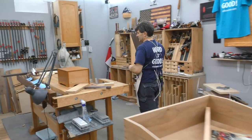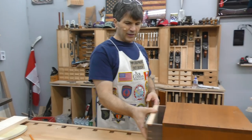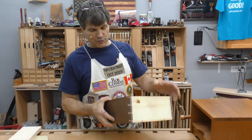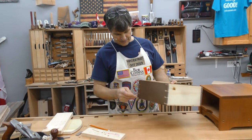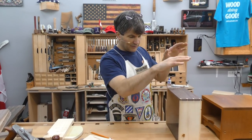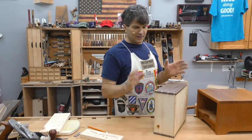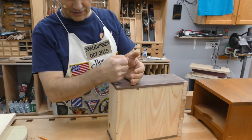In order to get that level of precision, you have to use a shooting board — go in and make sure all the pieces are square before you start. If you use the 140 trick where you use the skew block plane to cut that little rabbet, that'll help register the two pieces so that when you put this together there's no twisting. I assemble one corner, then the other, so now I've got a U-shaped piece. The last thing to go on is the other side, because the dovetail only goes together one way. So you put this one in, and when you come over here, if you've got to shift it one way or the other in order to ease the line-up, you've already lost your fit. It's so satisfying when you start tapping this one together and see that they're lined up perfectly and just have to tap them into place.